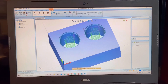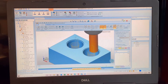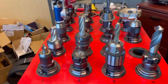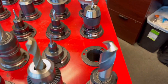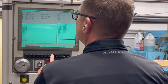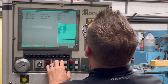It's really going to be a tedious job. This here basically analyzes the program to make sure that we're not going to have any tool crashes. It's going to have a flange on it and it's also going to be chamfered on the edge. This is my tool lineup — I'm progressively getting the drill bits a little bigger each time, since it's going to take so many passes to get this thing done.